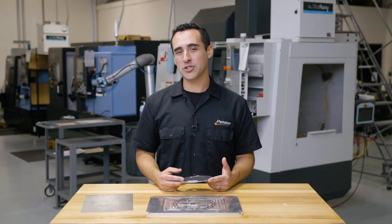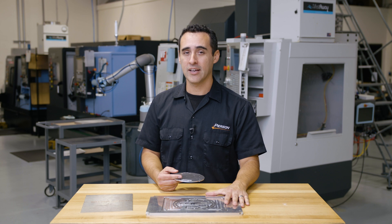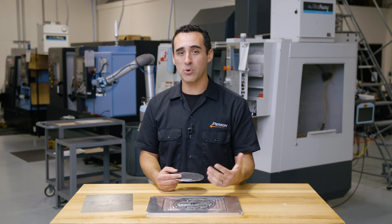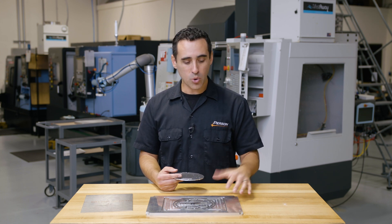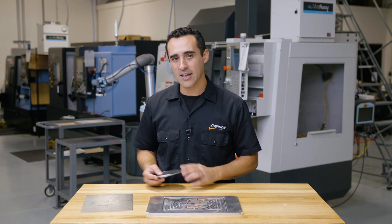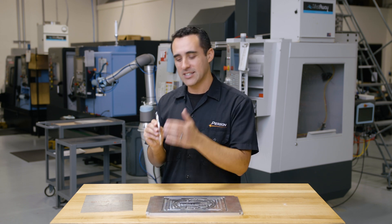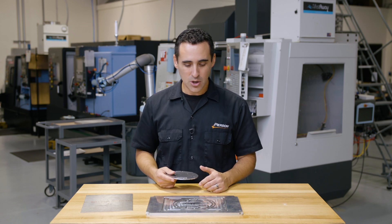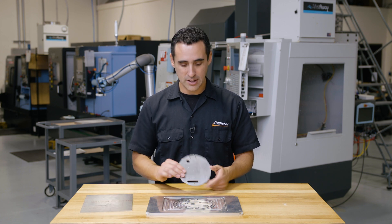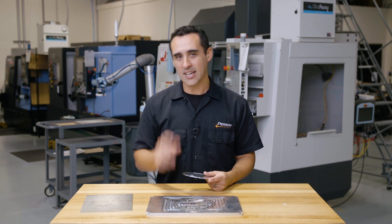In this week's Fixture Friday we're going to talk about vacuum chucking and specifically the use of a customizable top plate. If you're not sure what this is, check out the card for our vacuum system overview along with our top plate overview. In short, a customizable top plate allows you to create a gasket pattern that perfectly matches the shape of your part if the grid pattern doesn't do a good enough job. In this case we cut a customizable vacuum chuck to hold both the starting raw piece of material, the finished piece of material, and the remnant piece.